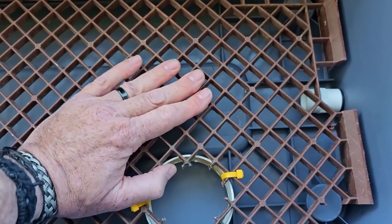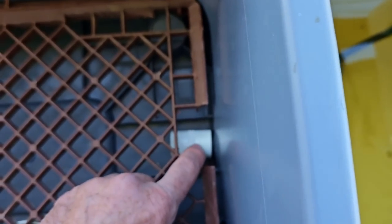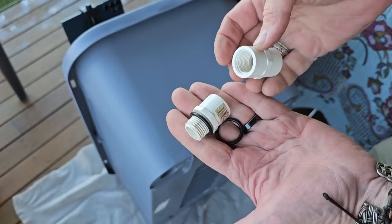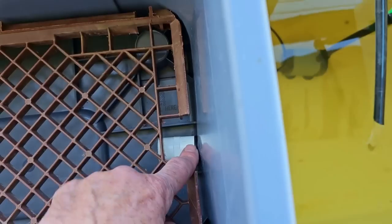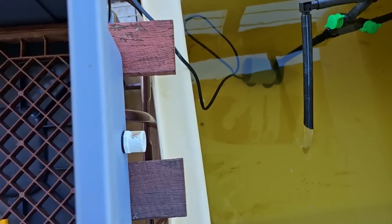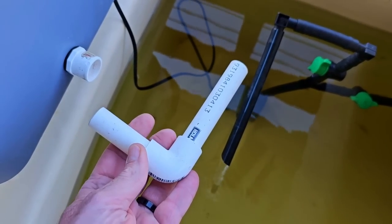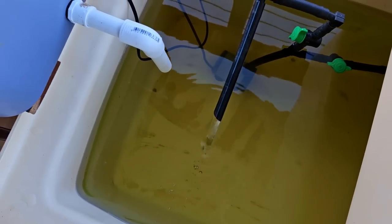So that's pretty much the base. As for an outlet, I've decided to use some 15mm or half-inch PVC pipe fittings. I drilled a hole in there nice and tight so I could screw the fitting through. The hole was very tight so I basically had to cut a thread with the PVC fitting, and I decided to pop another o-ring and another fitting on the inside as well — just to make sure that if it gets bumped and that thread becomes loose, we're not going to have any water leaking out. On the outside, all I'm going to do is push in a 90-degree elbow with sections of pipe, and that water will drain directly down into the fish tank.